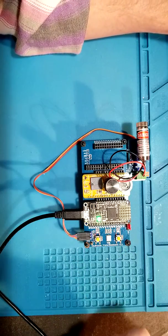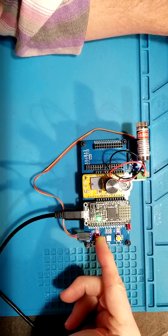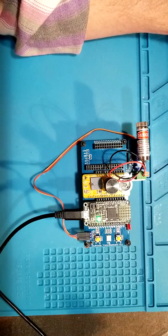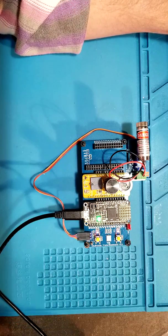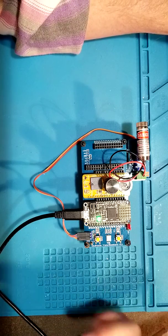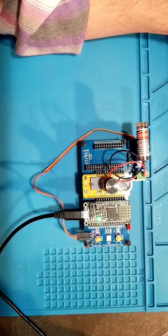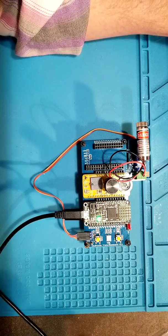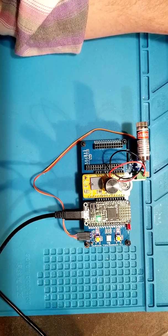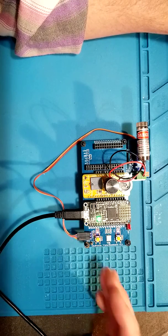I happen to know, because I wrote code.py, that the first thing it does is flash these two LEDs. So at this point, we actually know that the Feather board works, it's plugged in, and we have copied files over to it. So we also know that the USB cable has data wires in it and is not just a charge-only cable. If you got your cable from me, I guarantee you it's a data cable. Data cables are also known as sync cables. So you can be guaranteed that the cable is suitable for copying files over from your PC to the kit.